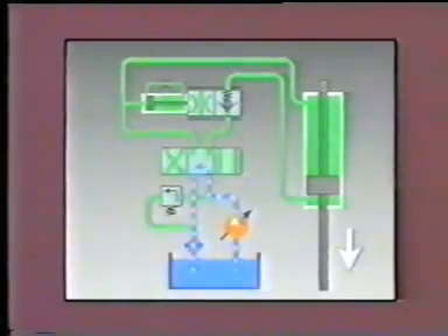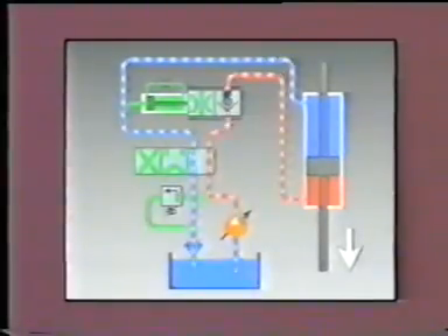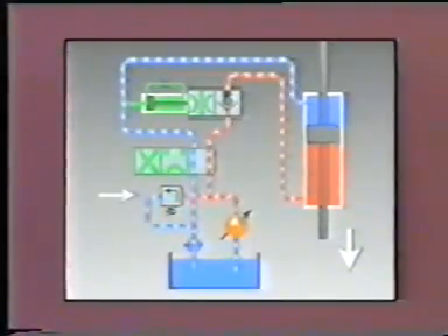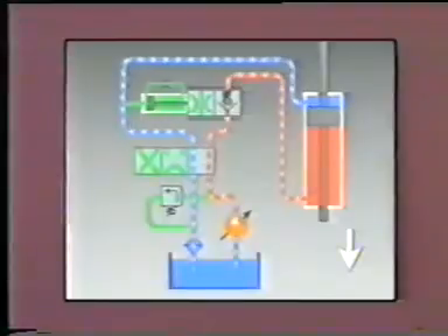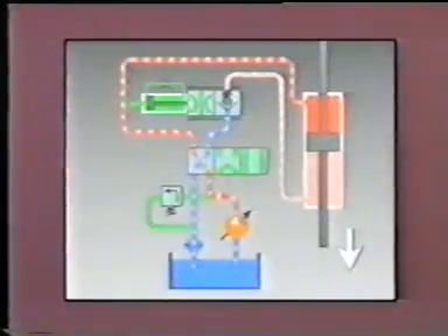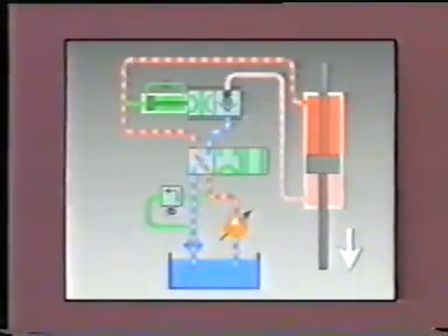In this situation, the deck is assumed to be overweight and the wind is not taken into account. The direction control valve connects the pump and the cylinder; the piston rod moves and consequently the bridge starts to move. If the forces on the bridge become too large, the pressure in the pipe work may become too high. The pressure relief valve starts working to remove the excess pressure. In closing the bridge, the flow control valve is selected — its operation is automatically controlled by the pressure distribution in the system. Because the action of the overweight of the bridge always works together with the action of the pump, the flow of oil tends to be greater, and the flow control valve keeps the velocity of the piston — and so the velocity of the bridge — under control.